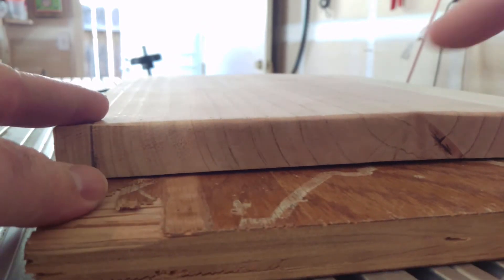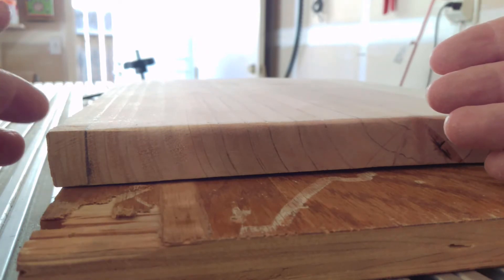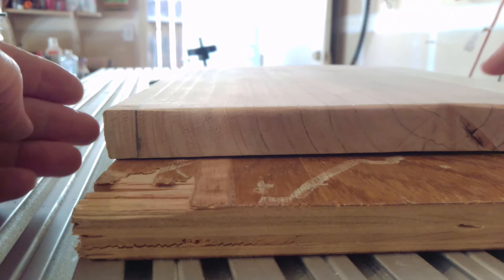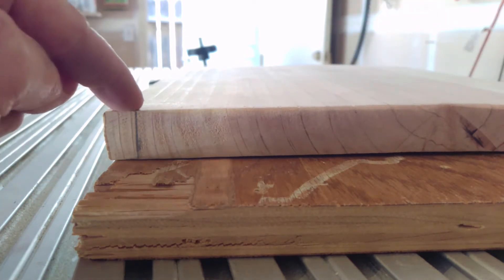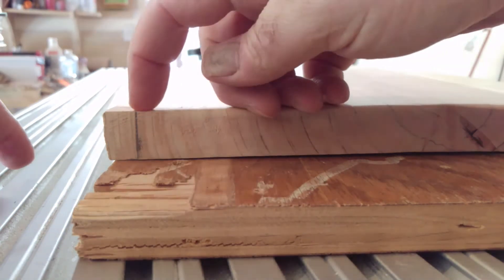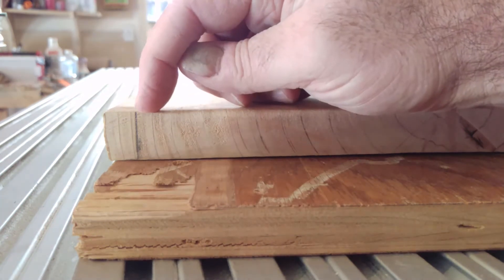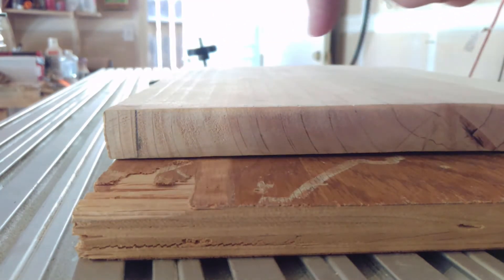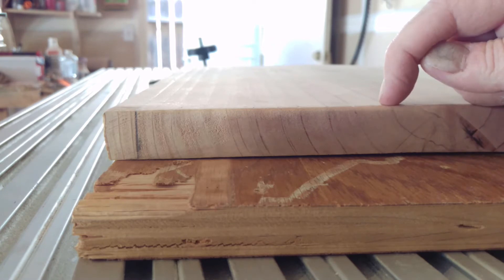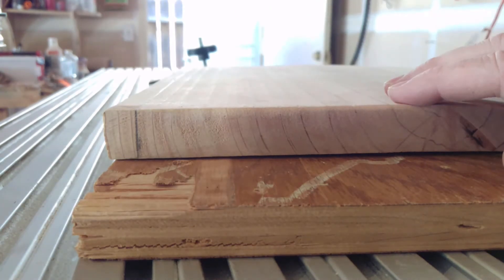What I'll do is clamp it right in the middle to push it down and do the most detailed work on this side. Here's why: if you're setting your home position to the material surface and one area is lower than another, your plunge depth gets thrown off. If I set it to point eight-five for an eighth-inch mill, it starts from the home position and goes down — but if one side is already three-tenths of an inch higher, instead of milling point four I'm milling point seven.